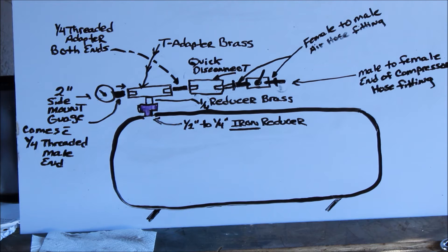Take off everything that's on the tank — that's the first piece to put on. Now make sure you get some thread tape, because the next piece that you're going to get is this quarter-inch brass reducer. Don't buy these things from Harbor Freight — I'll explain why in a little while. The tolerances on all their fittings are poor, and for just a few cents more you can get actually quality-made fittings. There's the little quarter-inch reducer; you're going to put that into that half-to-quarter iron reducer.